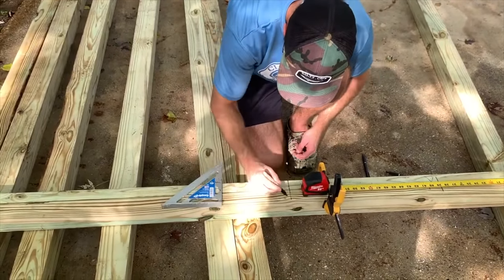Now, there are a ton of different ways to actually apply epoxy depending on the look you're going for. In my case, I took my 3 gallons of the lighter pigment epoxy mixture and I dumped it all over the floor. What I'm gonna do is I'm gonna create something called a slick coat, which is where I'm gonna apply one continuous coat across the entire application area.